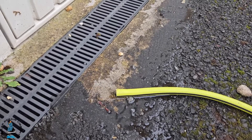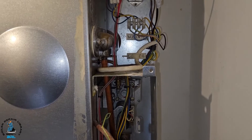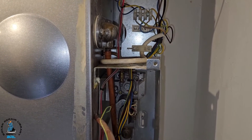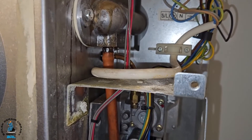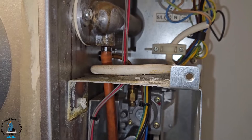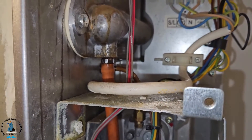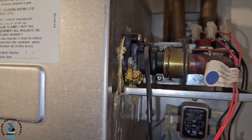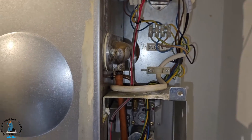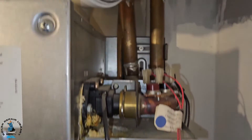That was a success - how to drain the system when you haven't got a drain off point. Having drained down the system, we now attempted to drain from here using our tube, but unfortunately this nut is seized - it's not moving whatsoever. This is where it's been leaking from, coming down here. So we're a bit snookered because this won't open and we can't get rid of this trapped water.